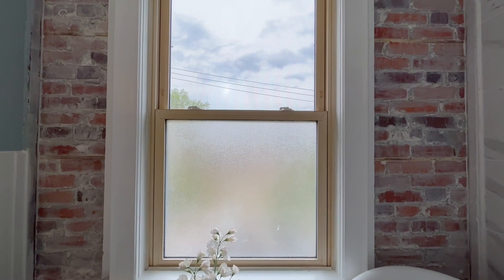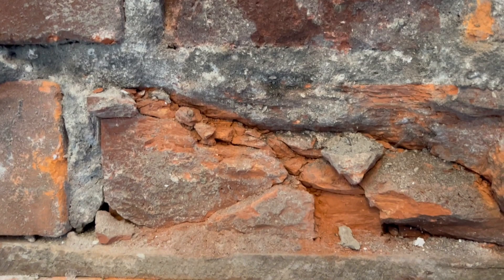It would technically make things whiter. I don't really like using paint on brick surfaces. My number one method for whitewashing brick is actually using a lime wash, but it means that your brick has got to be in good shape. If it's not perfect, the lime wash is just going to wash over some of the cracks and holes and damage.